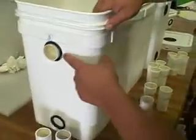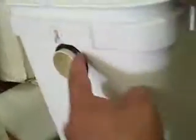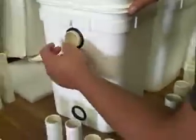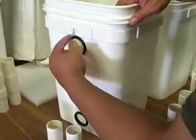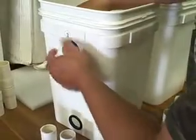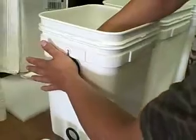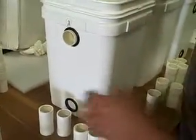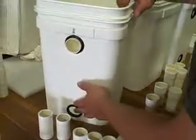Now when I take this and start to slide it in, instead of it being an impossible fit it slides right in. You can see here's the bell — we've got the thinner portion and then the bell portion. When we get to the bell portion we push it a little harder, and I'm holding it on the inside so that the rubber grommet doesn't pop out. I'm not just jamming it — I'm actually holding it and slowly pressing it in. The bell is actually stretching the grommet and making a very tight seal so that you don't have any water leaks.